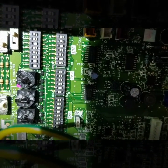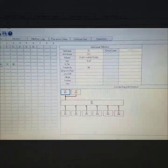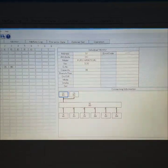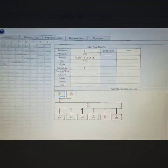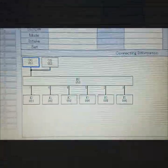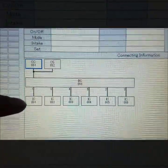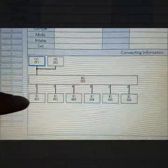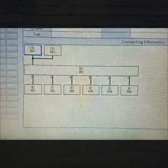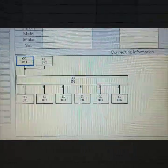I keep my tens column zero. Once you hook up the maintenance tool you can search for the addresses. Here you can see you can double-check all your work on your outdoor units and your branch box — it's showing what they are all addressed as and what port they are hooked up to. This is a good way to double-check all your work to make sure your addressing was done correctly.